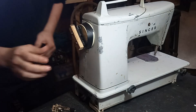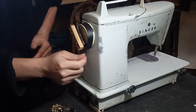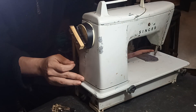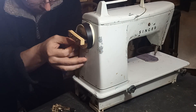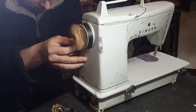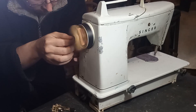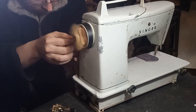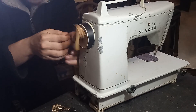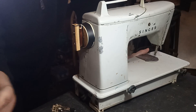Make sure it's packed down into the coil. I like to do about the first 30 to 50 wraps by hand to really make sure the pickup lead is secured down inside that coil. Then I step on the pedal and take off winding. No, this is not sped up at all — this thing is just way faster than a commercial pickup winder. I'm trying to act like a machine and get a constant traverse of like one to four, but I can't keep up with the speed so I'm having to come back and scatter wind to fill in little holes. In less than two minutes I have a pretty decent coil. I bet that's about 2.2k to 2.4k, something like that.